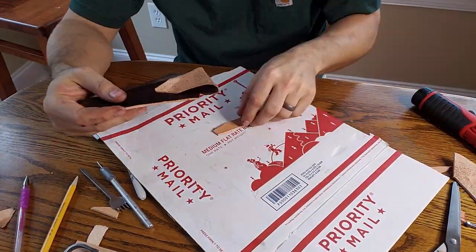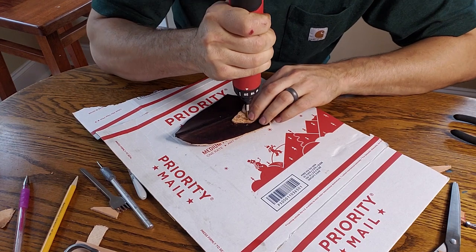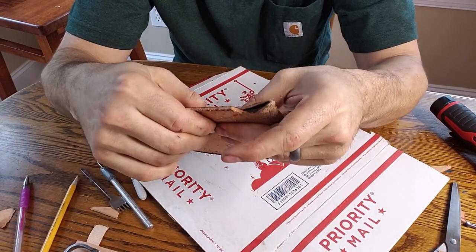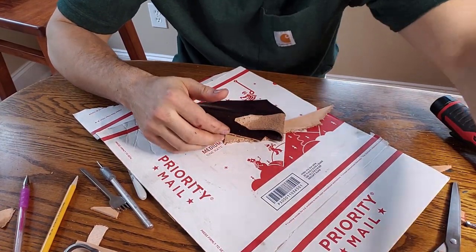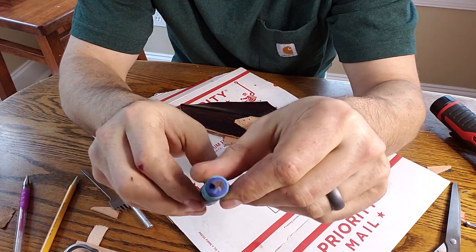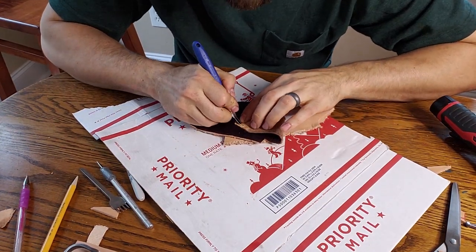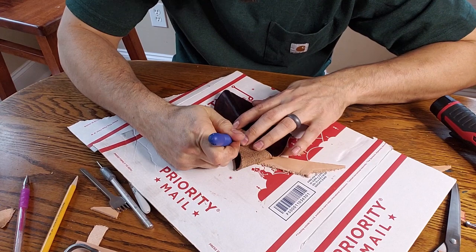Mark my holes. It went through on the back side and on the front side. The next thing I like to do is take a V graver — I forgot to show this earlier, but I also use a V graver in this process. That V shape cuts channels so that I can sink the thread under, so anywhere it's going to rub against a body or possibly up against the knife coming through, I want to create a deep channel.